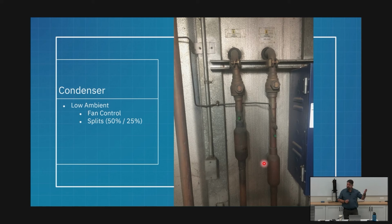Right? So I want to get that refrigerant out and back into my system, or I'm going to run out of refrigerant. I've got a second receiver if I don't. Right? Thinking of it that way, I'm going to fill my condenser full of liquid that I can't get out. I'm going to be short refrigerant. Okay? So in order to do that, you can see there's another little pipe.